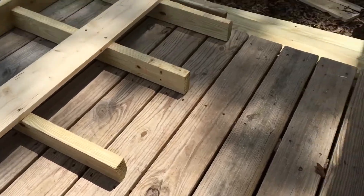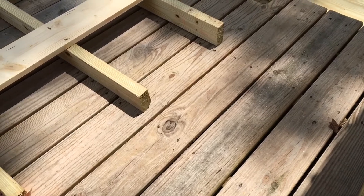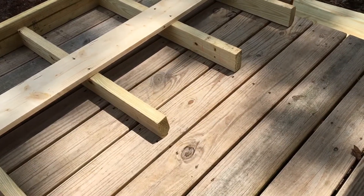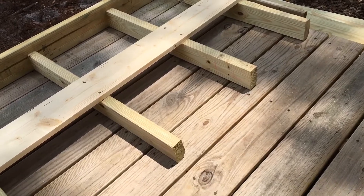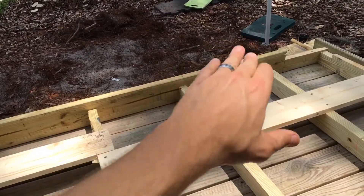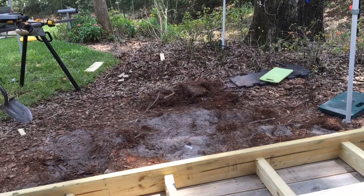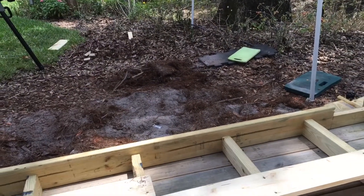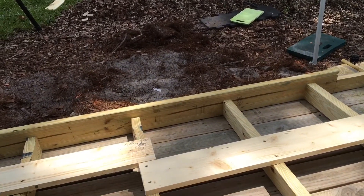The tails are just straight. If you were really doing this on a concrete pad that's sloped, you'd need to trim those tails off and feather them out with a circular saw or hand saw. In my case it's just as easy to dig it because of the topography changing. There are lots of sticks in here and matting from what used to be lots of ferns — you can see that brown matting — and once you get through that carpet you get down to the sand and dirt.